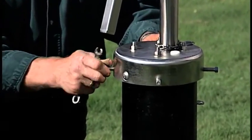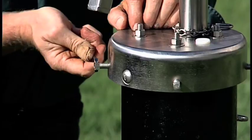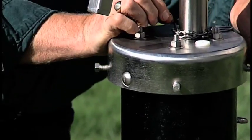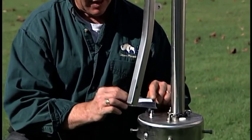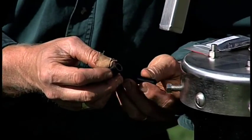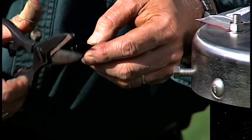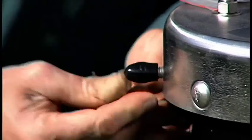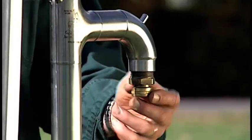After tightening the top nuts, tighten the set screws on the side of the casing. Turn them in by hand until they stop against the casing, then use a three-eighths open-end wrench to snug them up solidly, again going diagonal each time. In your kit you'll receive a packet of rubber bumpers — hold one against the side of the casing, mark it with your finger, trim it with scissors, then push it over the head of the bolt. Do that to all four nuts and you're done.